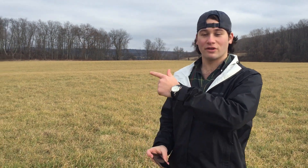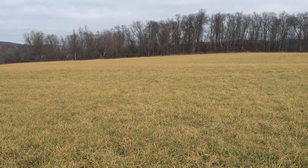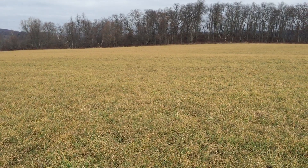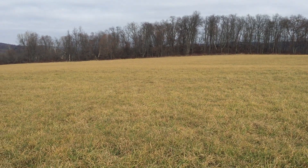I put my building envelope in the middle of the grassland here, next to the prime farmland, in order to have a solid foundation for my building. I didn't want to put my envelope in an area too close to wetland because that would be a bad place to have a building as a result of the ground and soil type. Also, there are requirements that prevent buildings from being too close to wetlands.